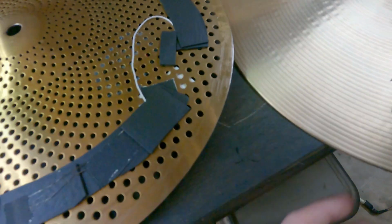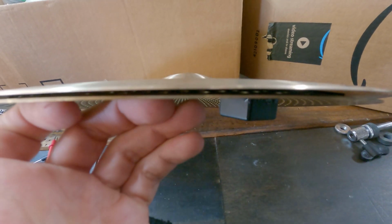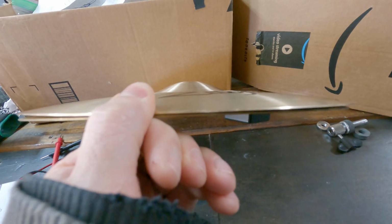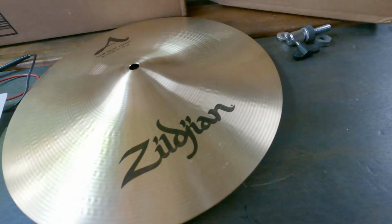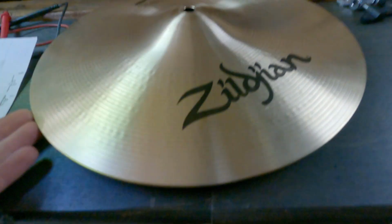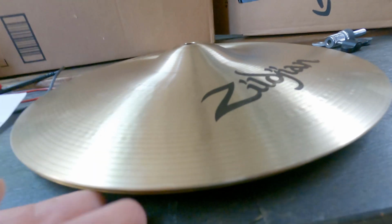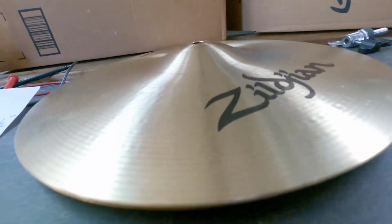And then what happens to get our switch, because the foam is separating the 2 pieces of metal, when we touch the cymbals together, we're completing the circuit. And that's what is our switch. So when it's in resting position, we have a gap. That's our off position. When it's squeezed or struck with a stick, that is the on position.